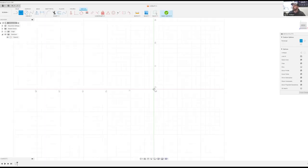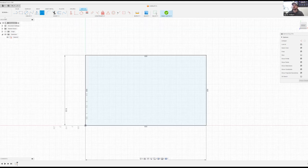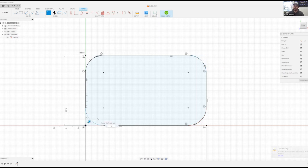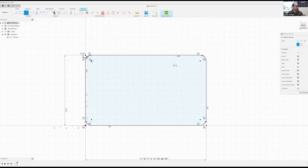We're going to start by just drawing an arbitrary rectangle and assigning some dimensions. This sign is about 10 inches by 6 inches, so we're going to start there. Next I just want to soften these edges so we don't have sharp points on our sign — it'll look a little bit better cosmetically. We're going to assign those to be a half inch in radius. And then lastly we're going to add in our through holes, and this is going to be the backer plate to start.